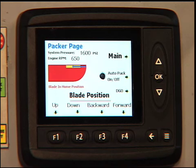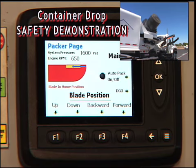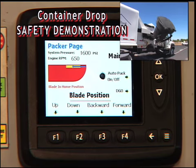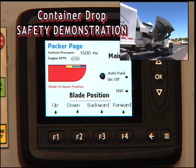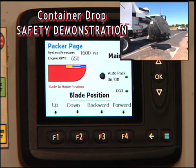At the point when the can is then at the top of the hopper and the operator is standing on the ladder, the operator can then push the can off onto the arm, go back into the cab, and let the arm down slowly and let the can down safely to the ground.